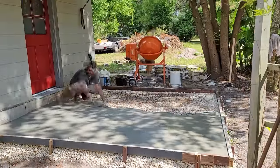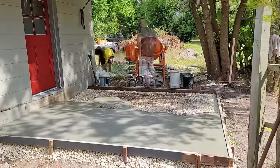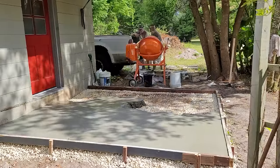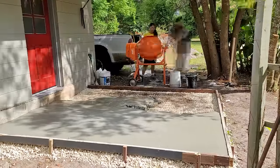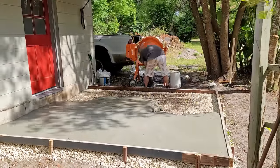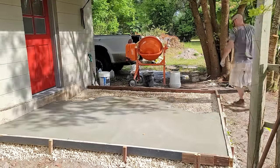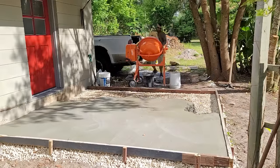What do you think? I have to admit, this process took a little longer than I expected. Putting in the rock and then pouring the concrete took us eight hours. We ended up using 52 bags of 80-pound concrete, most of which I would mix one bag at a time. I got about a bucket and a half of wet concrete out of each bag of dry concrete.